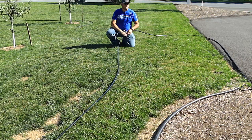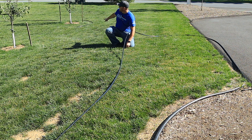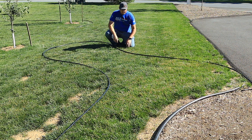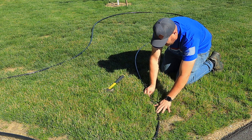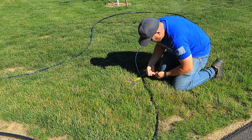I finished coming down along the side of the garage. I'm going to go from the corner where the mulch stops, diagonal across to the first tree, and then just wrap around the trees in a clockwise fashion with the half-inch, then tap off of that with the quarter-inch and the dripper tape. I don't want to just lay it on top of the ground, so I'm going to try to bury it down inside the ground, get in between the blades of grass, and hopefully stay away from the mower. Never fails — I get down about three-quarters of the way and hit a rock.